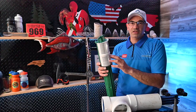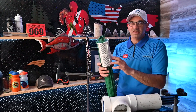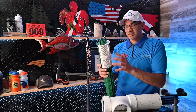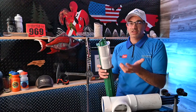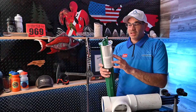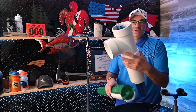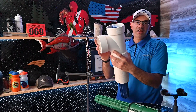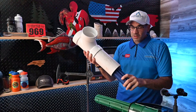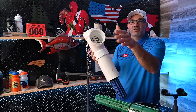So this is critically important. It's just like any other filter — think of your favorite filter: it needs to be cleaned, it needs to be changed. Not having a filter is even worse because then whatever may leave your tank just goes right into your leach field. Most of our leach field repairs are due to this piece right here — either the baffle failing, an old concrete baffle that has broken, or solids getting through the baffle and into the leach field.